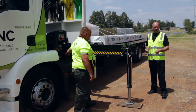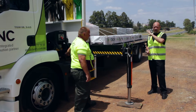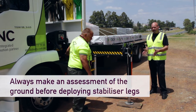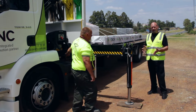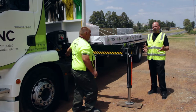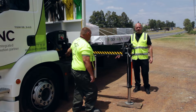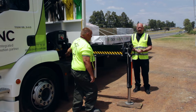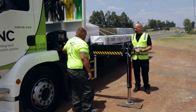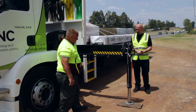You can't trust the surface, so you always make an initial test and assessment no matter what. Even if it's bone dry and looks rock solid, you make absolutely sure that what you're extending on is safe. Some clues are really obvious ones if you know to look for them. As Bob drove onto the site, he left absolutely no tyre tracks, so he hasn't sunk into the mud at all. That gives you a good idea that the bedrock is well compressed, dry, and safe — and that'll determine how much blocking and packing he needs to use.